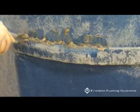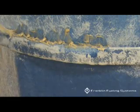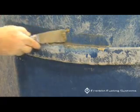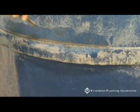Smoothly apply the catalyzed putty with a 4-inch putty knife to the outside joint of the sump while pushing the putty down into the joints. Fill in any open areas of the joint with the catalyzed putty. Create a smooth surface for the mat to bond to by using a Bondo knife to smooth the catalyzed putty around the joint. Make sure that there are no holes or cracks in the putty, as this is the layer that creates a watertight bond to the sump. Allow the putty to sit for at least one hour in temperatures above 70°F so that the putty can harden. Make sure not to disturb the sump during this time or it could become misaligned.